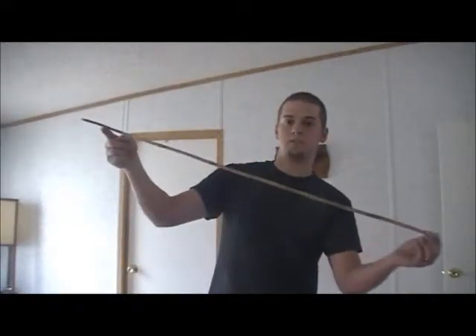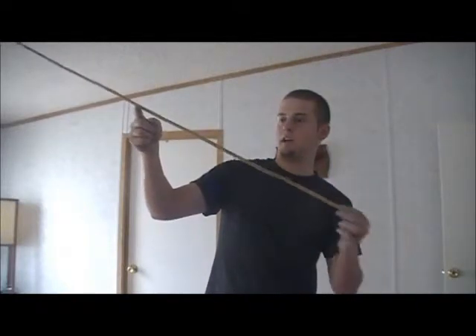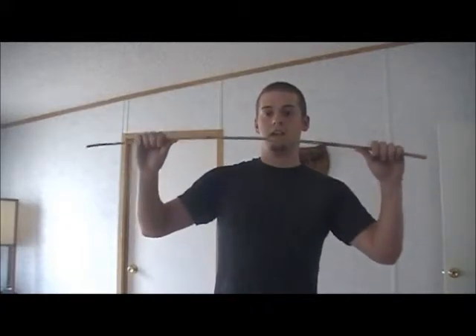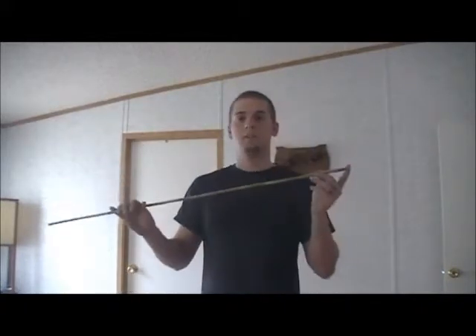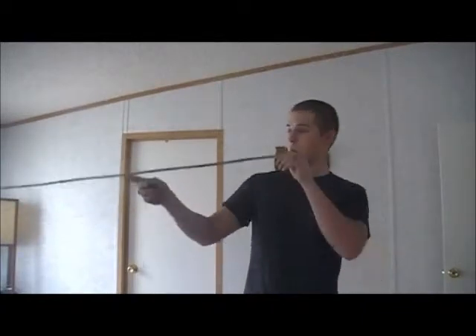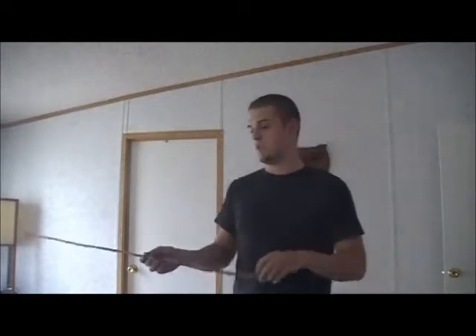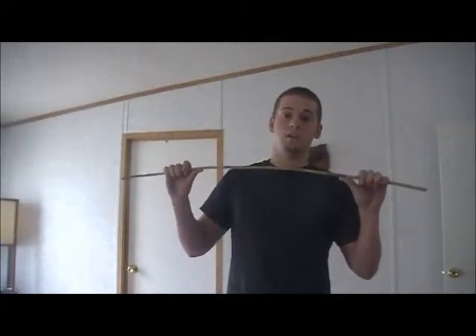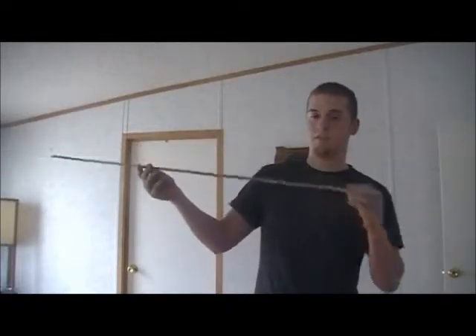This one's actually pretty straight too — got a little more flex, but it's not nearly as able to just be bent and stay bent. The moisture has completely gone out of it, so even if you flex it, it doesn't want to stay in its newly flexed form; it wants to go back to its original form. Whereas if it has moisture, it'll warp. The green one — 10 to 15 minutes held bent and it's going to have a very strong warp. I can hold the dried one for 10-15 minutes and there won't be anything.